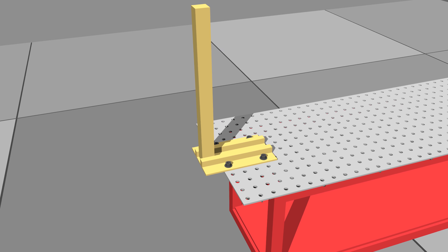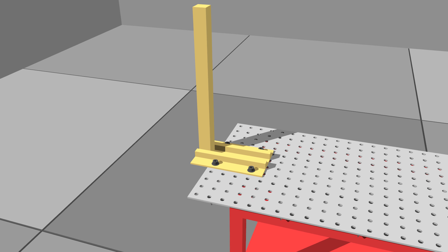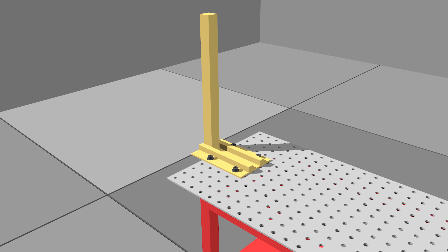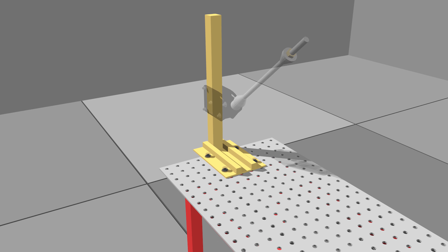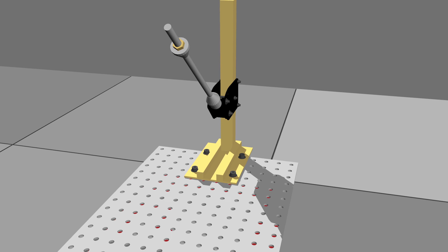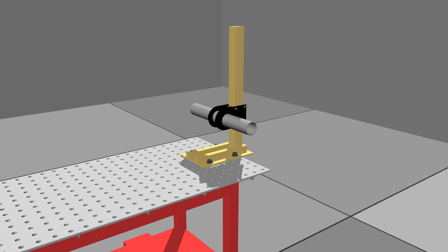Both will be based around a simple plate and post structure, where a large 3/8 inch thick plate gets bolted to the table, a parallel set of 1x1 square tubes help hold up a single vertical 2x2 post that the adjustable alignment fixtures get bolted to. For the front, a conventional steering column frame jig neck fixture is used, albeit with a longer threaded rod for my design. In the rear, I'll fabricate a custom clamp out of shaft collars and plates for my large diameter spindle.